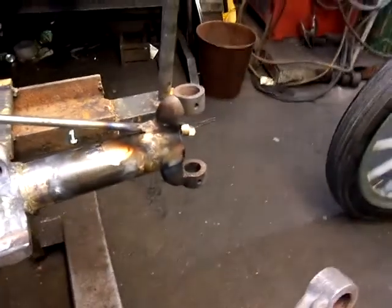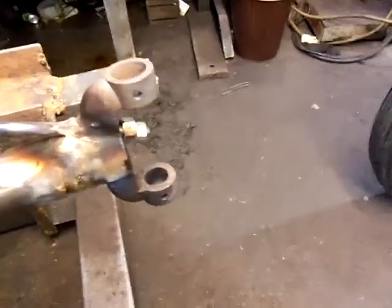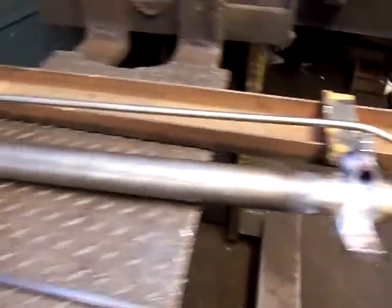Here's how I put that draw rod on there. I drill it the whole way through. I stick a nut on it, draw it up, and silver braze it in there. Then I take the nut off, put my braze in there, and tack it. You can see on this one I'll tack it with some braze at the top after it's tight.